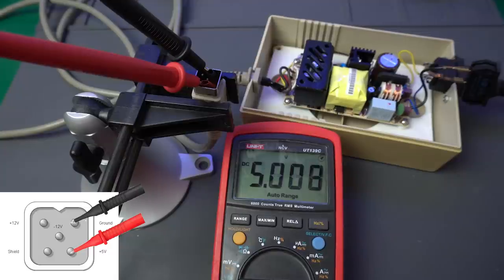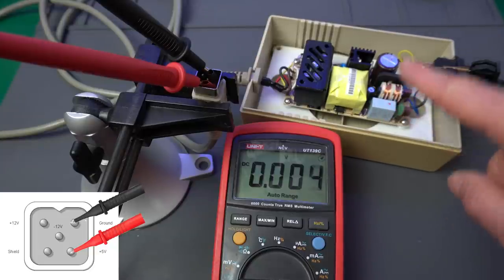Perfect. 5 volts. Okay. I'm going to turn it off. I don't want to spend there too long since, as I said, there's no load. Normally you would test this with a real load on the power supply, but I don't have the right device. I don't even have what they call power resistors. There'll be a resistor that maybe can take 2 amps through it, which I think is the bare minimum load